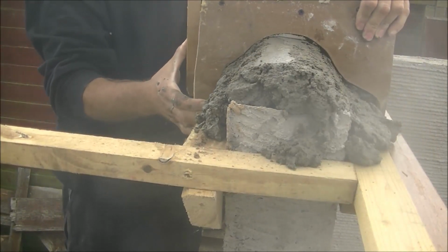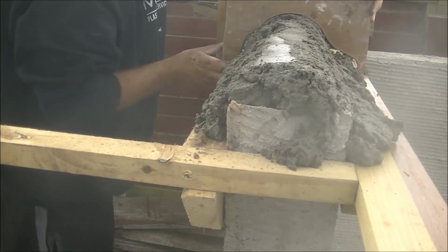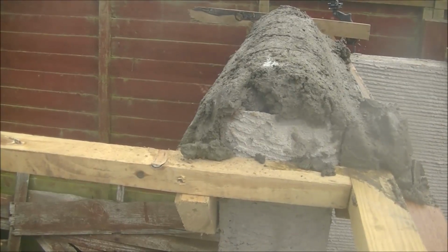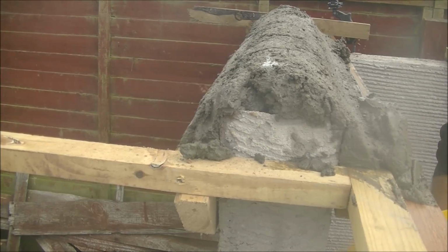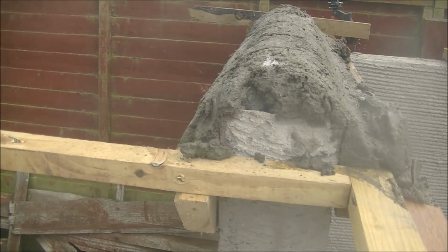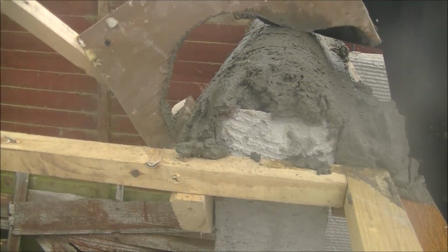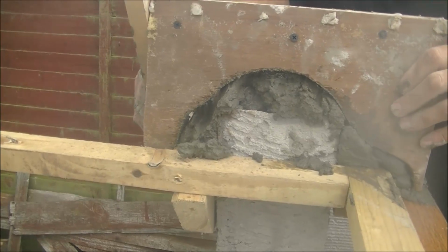And with my running mould here, you can see it's not metal, there is metal there, but I have a wooden template over it, and basically that's called the muffle. So I wanted to muffle it down and leave myself about 5-6 millimeters to be able to render over with the render coat then, same day. Wanting to do it always on the same day, didn't want to leave it to the next day, so that it would bond well.